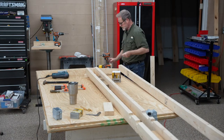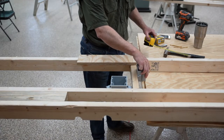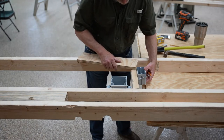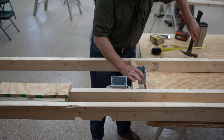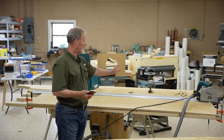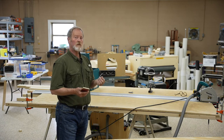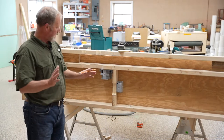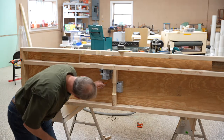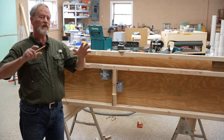On the tops I use these two-and-a-halves. I want the box for the light switch to be about eight inches off the wall, so I'll take a measure and roughly place it there. The vertical placement of the box is dictated by the sheathing. The little tabs on the side are sized for sheet rock, but we've got three-quarter inch ply, so we need to place it a bit higher. I've just cut out a panel with my track saw — that is going to be the first panel that goes up on this plywood section. I've left myself enough room for an overlap on the 2x4, and that will help give good stability when I put my next panel up. I need to cut out holes for the electrical boxes — they sit proud, so there has to be room for them. I'll take a pencil, draw in, and stay proud of that by maybe a quarter of an inch. The cover plate will cover things up nicely.